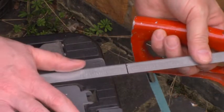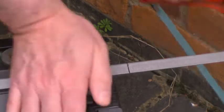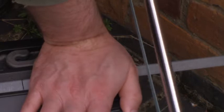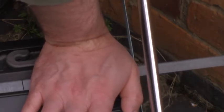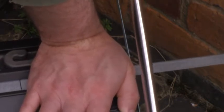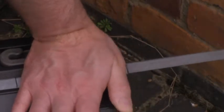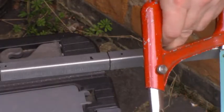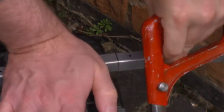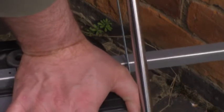I'm using an old tool box which has a little V cut into it. Note how I keep the blade below my thumb — we don't want to slice thumbs off doing this. Keeping it tight up beneath your thumb allows you to steady the blade and cut more easily. You cut from one edge to the middle, when you get to the middle you turn it and then you carry on. If you try and cut through the whole thing at once, it's difficult to keep it exactly straight and stable — you never make such a good job as doing it in two pieces.